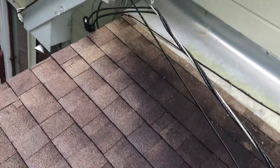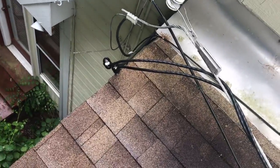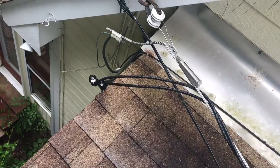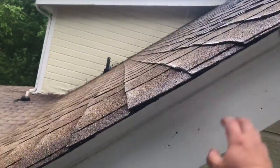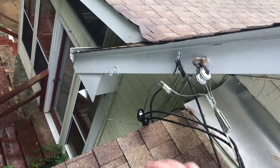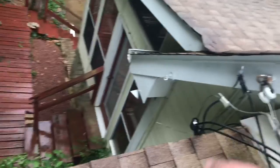That's all I have for now, but like I said, it's an easy fix. I don't know why the contractor put this addition on without addressing this — maybe nobody told the owner, or the owner didn't care — but it's a significant safety condition. Also, this house has wooden fascia but it feels aluminum like most houses, and it can actually ground out under the fascia. You could have a kid walking around touching a downspout or a gutter and be electrocuted. It happens — it's possible.